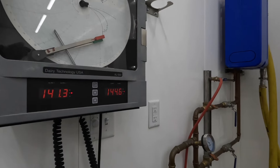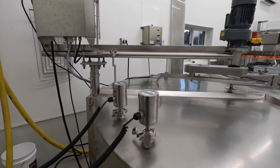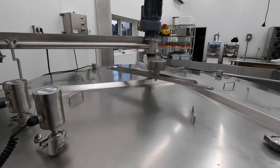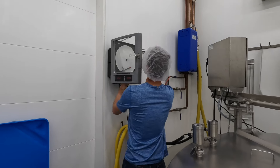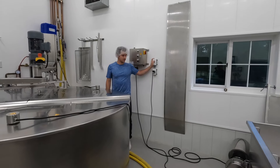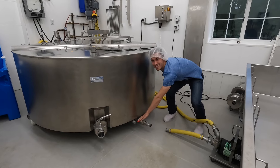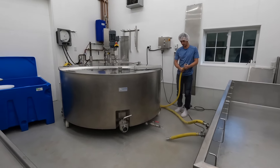They've got the temperature recorder here, recording the temperature of the milk and also the air temperature above the milk. There are two probes — one goes down into the milk and one is just below the top of the lid. We just hit our target temperature of 147°F, and now they're marking that on the charts so they have the record for this batch. We shut off the pump, drain the hot water from the jacket — make sure you have your fan on otherwise it gets steamy — and then they'll start pumping cold water through the jacket to start cooling the milk.